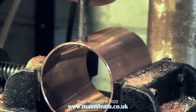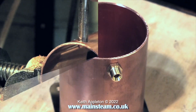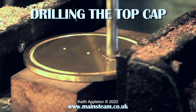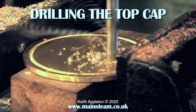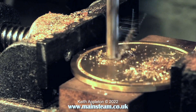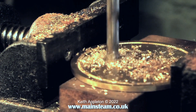Once tapped, I screw in very tightly a brass union like this, which is also soft soldered to the copper barrel later on. Because it's threaded as well as soldered, it's a very strong watertight joint. When I had these parts engraved, the engraver used to put three spots on the inside as a guide for the drill bit, also tapping size for 5/16 by 32.